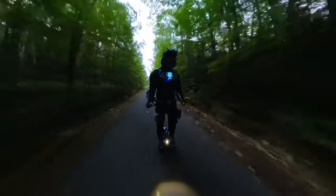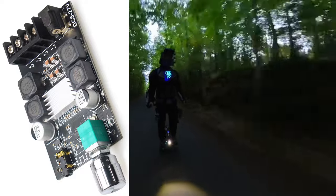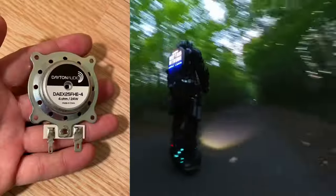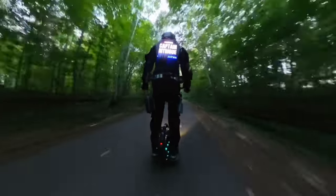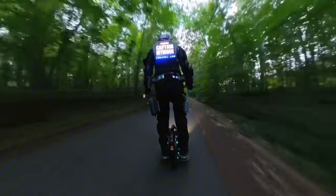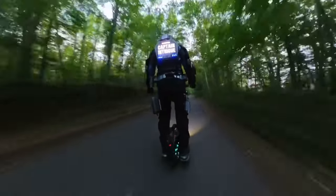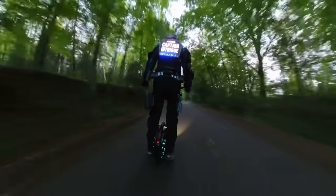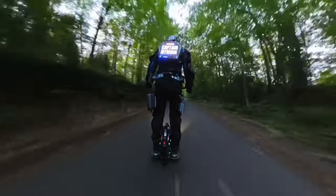To amplify the voice signal, I used a 50-watt mini stereo amplifier — links in the description — and I used the amplifier to drive two exciters instead of speakers. Of course, this amp is overkill, but it matched the physical size of the voice changer circuit perfectly, and I wasn't sure how much noise I would have at full power, so I chose this amp so I could turn the volume way down and have less noise. In hindsight, I could have gone with a much smaller amplifier.